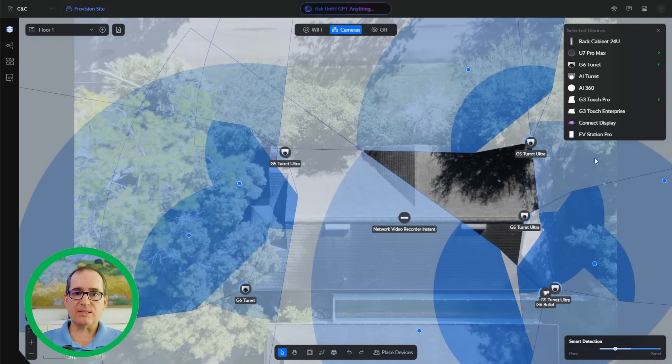I really recommend doing the Design Center step quickly, especially if you haven't done an install before, just to make sure your camera logic and placement are appropriate. I'm also going to put a link to all the tools we used: a ladder, a drill, a screwdriver, spade bits, electrical tape, RJ45 ends, a crimping tool, a wire stripper. There are also two specialty tools you may need: fish sticks, which are fiberglass sticks you push down a wall cavity, and fish tape, which is a metal or plastic tool for the same purpose. I'll link to all of those in the description.